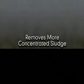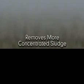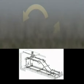The Siggert Scraper system is the solution to a number of common removal problems. Other more traditional systems actually agitate and dilute the sediment layer as they operate, causing plants to handle much greater volumes of discharge sludge than necessary. This reduces the overall efficiency of the entire process, raises costs, and creates disposal problems because of the additional volume.